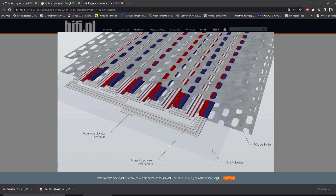Normally, there's a substrate and the magnet sits on it. Let's say the north is facing the metal substrate and the south is facing the coil. In this case, the coil is actually on top of the magnet, whereas normally it would be in between the magnets. The next magnet will be reversed — north on the substrate, south towards the coil — and the magnetic field will be in between, which is why the coil usually sits there.